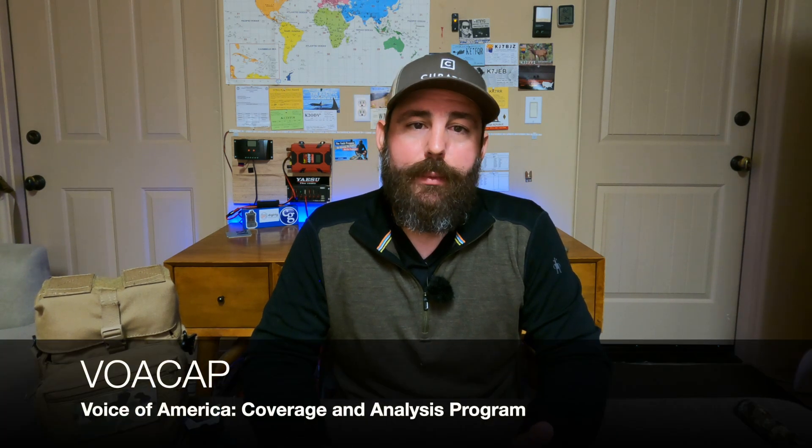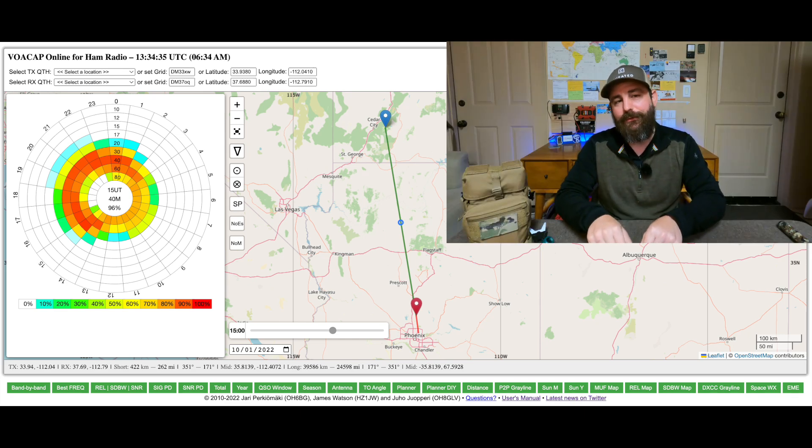Let's start with the plan first. Mike reached out and said he wanted to establish a contact while traveling in Utah. The first thing we did was use a tool online called VOACAP and performed a propagation analysis. It's designed for RF engineers where you can establish the day of week, time of day, enter your location and the other station's location, your antenna heights and systems, and it will give you a prediction on which bands at which windows in the day work best. Knowing Mike was in Utah and I was in Arizona, I plugged in all that information.